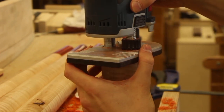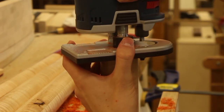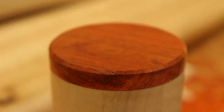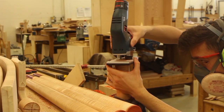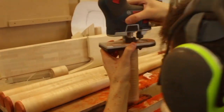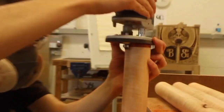I wanted to add a chamfer on the top and I did this in a few passes. The first pass was very small — taking a really small amount of material off — then I raised the router bit up each time to cut more off. In the end I got quite a heavy chamfer to match the chamfer on the side rails and the curved rails, so all the chamfers are the same size throughout the piece, which is a nice thing to have.